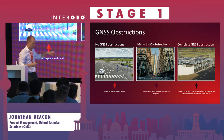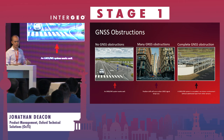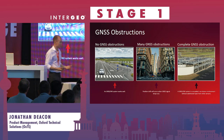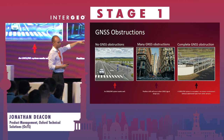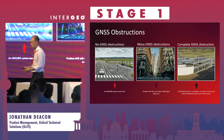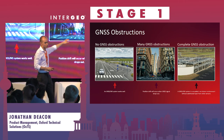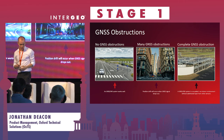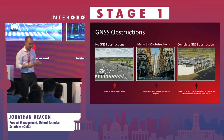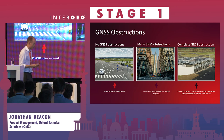When you're on the left-hand side, we can achieve good global position quite easily. On the right-hand side, going by a SLAM system, you can achieve relative accuracy quite easily. What is difficult is finding a good global position for areas where you have poor GNSS. And that's the reason for integrating a different type of sensor into an INS system.